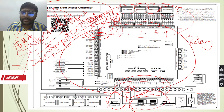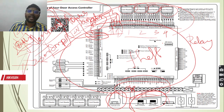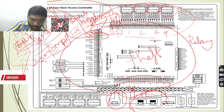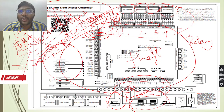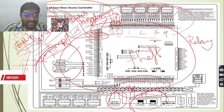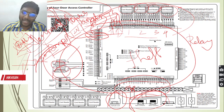The next most important thing is that if any theft is happening or if some person is illegally accessing, in such occasions we need to raise alarms. For that, we need to trigger some alarm relays. For the alarms to work properly, we need to provide external 12-volt supply for those relays to operate properly.